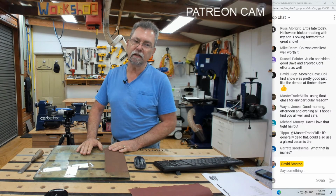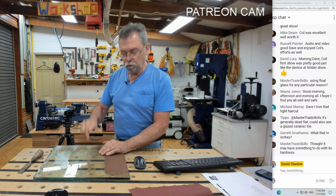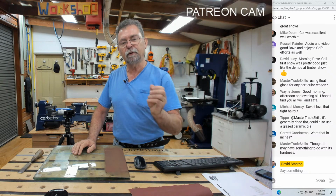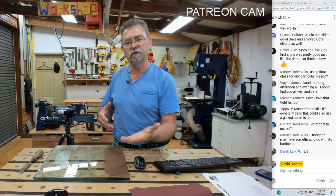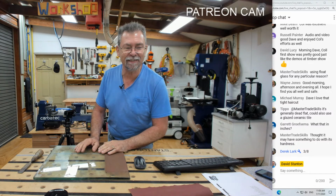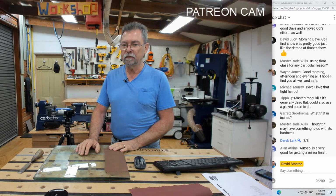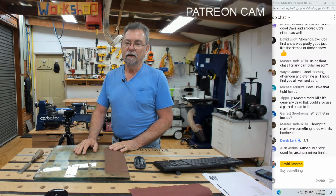Now you can get that same tolerance basically. For us, it's going to be good enough with a piece of float glass. If you use 3mm float glass, it's liable to break as you apply pressure. So try and find something that's around 6mm, 3/8 of an inch. Thank you. I'm presuming that's what you said, Derek. All right. Now, what's that in inches? Okay, Garrett. There you go.